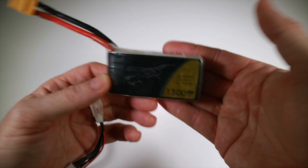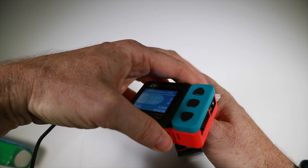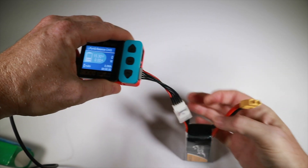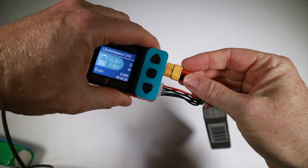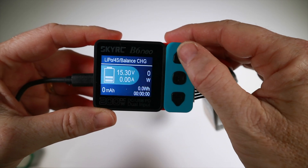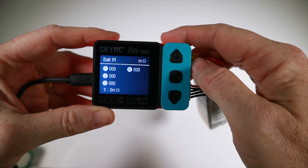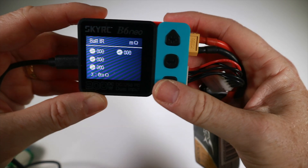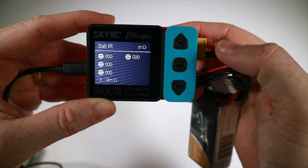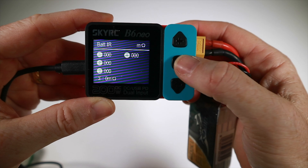What I thought to do is grab a quick battery - we've got a sort of typical flight battery, a little 1300mAh 4S. I've got a little balance lead extension which I find particularly useful because you've got a little bit more room to move your batteries around. That tells us what our battery is currently on and shows us the cell voltage. The battery internal resistance shows as zero - it needs to do something to record that.